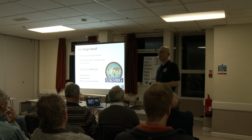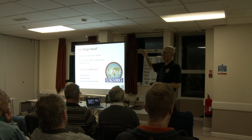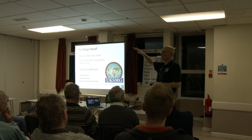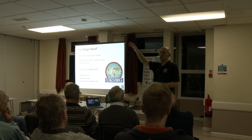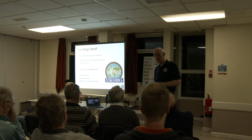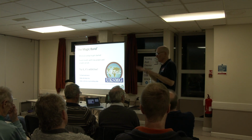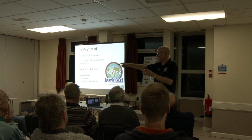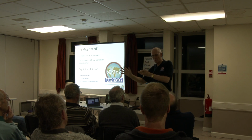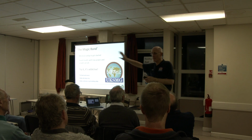Keep listening, patience. Certainly when it comes to looking for the long DX, you sort of work out roughly when it's likely to be. So the JAs will be sort of 7, 8, 9 o'clock in the morning. To the west, it will tend to be sort of afternoon and evening, to North America. And you just keep looking and listening and watching what other people are working. Because some people would say, well, there's no point in having that information, because just because he can hear it doesn't mean you can, but you can see it move. Sporadic E tends to move, well, in fact both, and F2 as well, they tend to move west to east.